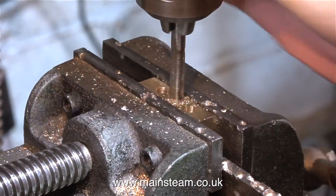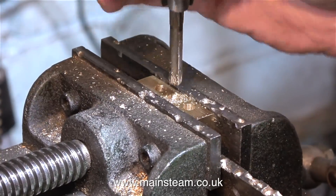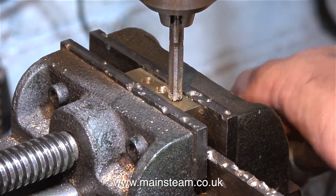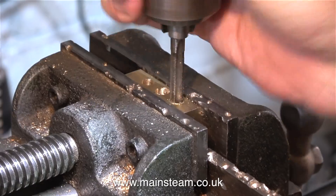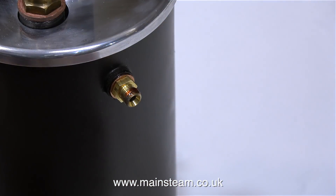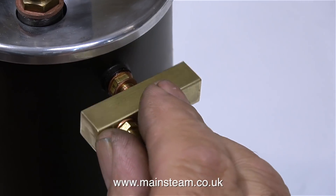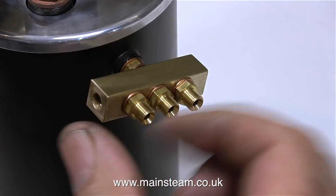The sequence is the same as usual: first I use a centre drill, then I use a 7/32nd of an inch diameter drill, and finally I thread the holes quarter by 40 threads per inch. The middle hole goes all the way through and is threaded at both sides. The centre hole is drilled and threaded all the way through so it can be screwed onto the double union that's already in the boiler. Three more commercial double unions complete with brass washers and Loctite 542 completes the assembly, after which the entire three-way adapter is screwed to the existing union fitted to the boiler, once again with some Loctite 542 and a copper washer. I was lucky with this part — it just took one washer and it was in exactly the right place once it was tightened up.